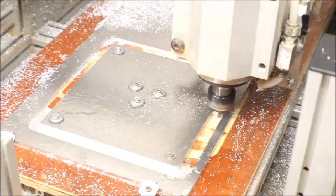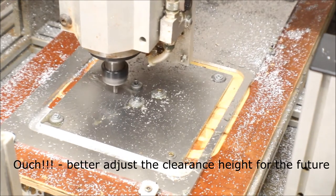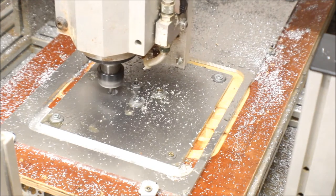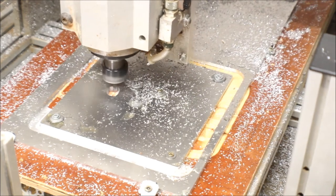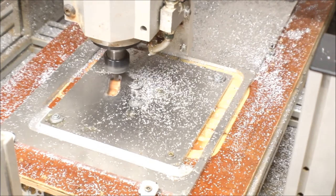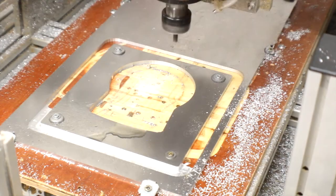Now you can also see there's a small skin of aluminium left on the bottom. Oh, there was the reason why maybe I should have just hogged out the middle of that shape, because that just nipped the screw. And actually, if you can hear the tool path, you can tell that that tool is now essentially blunted and probably past it. It's prime and won't be used again for aluminium, certainly.